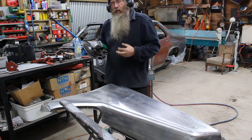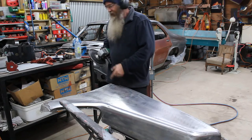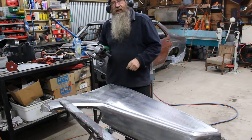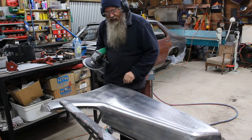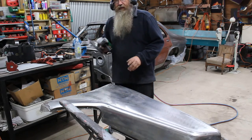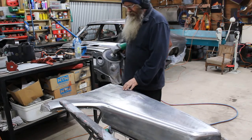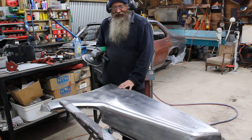It's not going to bring down a great big warped area — that's where panel beating comes in. If it's a very big high spot, you're going to have to panel beat it and possibly de-shrink it with traditional methods. However, this is very, very good at trying to get that final shape and get the panel to pull back into a nice taut panel again. You can see here that's oil canning — it's springing back out to where it's got to be. That still is a little bit full. If you've got a panel that is oil canning, you can use the shrinking disc on that panel and hopefully it will eliminate a lot of that oil canning. You may have to do some traditional heat shrinks with the oxy torch. Hopefully you'll have learnt a little bit about what this tool does.